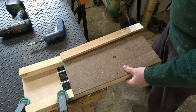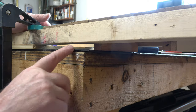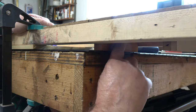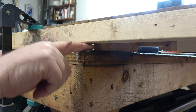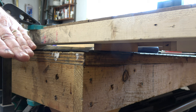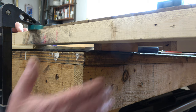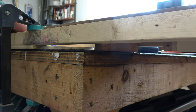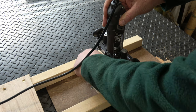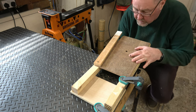You can see the actual piece of wood the router sits in — the router sits in this bit here, and I've got that resting on the edge of my workbench. You can see why this bit here needs to be roughly the same depth as that bit: if it's any bigger, the router table will be tilting one way; if it's any smaller, it'll be tilting the other way. If it's tilting slightly, it doesn't matter unless you're using a long piece of work. I'm going to put the router on it now — I've run the rod through, clamp these down on the rod, and that is solid in there. Just to check that the table is absolutely solid.